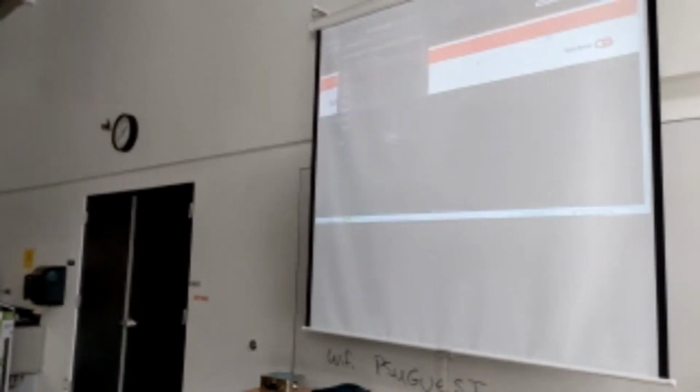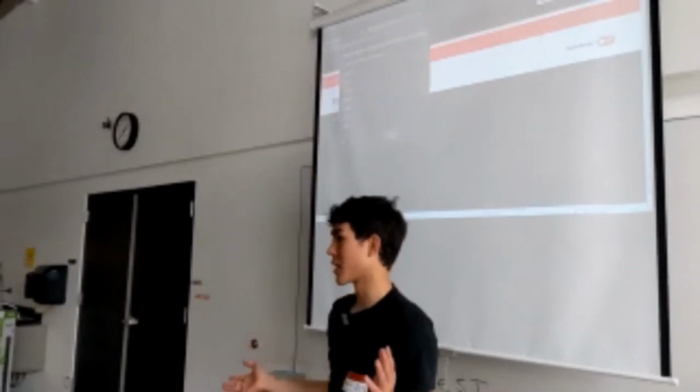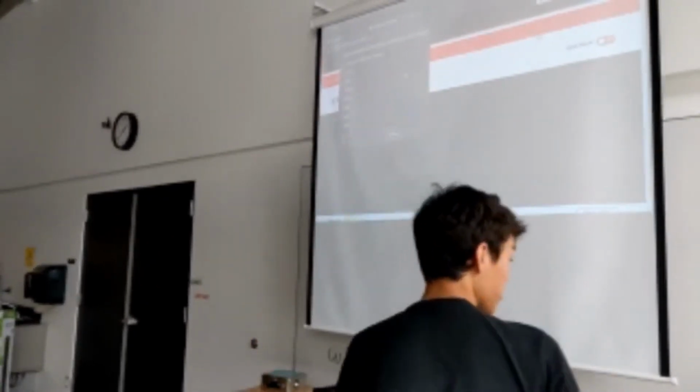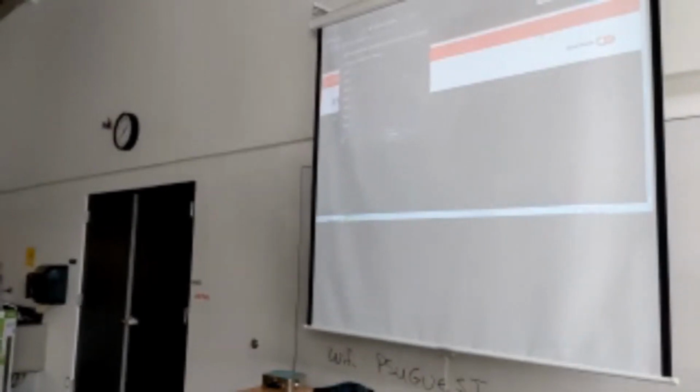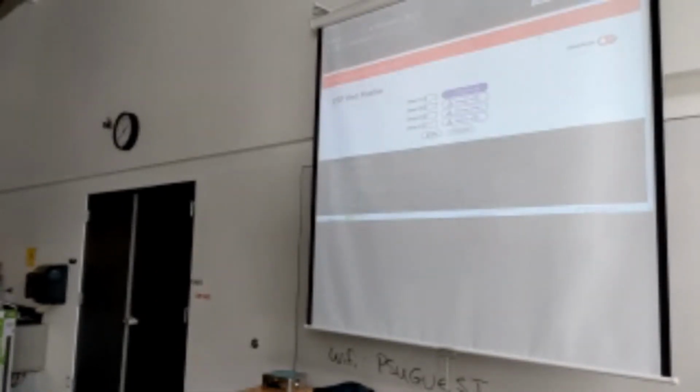So when I hit connect, the device that you're looking for, as I mentioned earlier, this is an ESP32S2 based device. So your Nugget should pop up as an ESP32S2. You'll go ahead and connect to that microcontroller. After it connects, it should identify your device and allow you to upload a file. Once you've done that, you just hit choose a file and select your binary file.